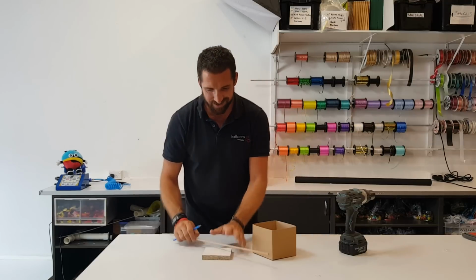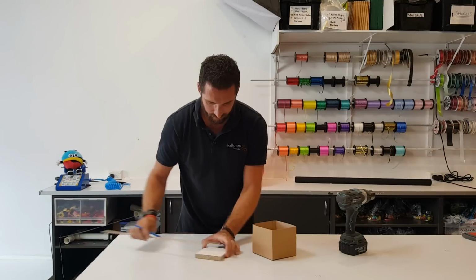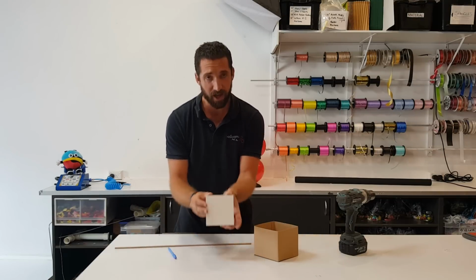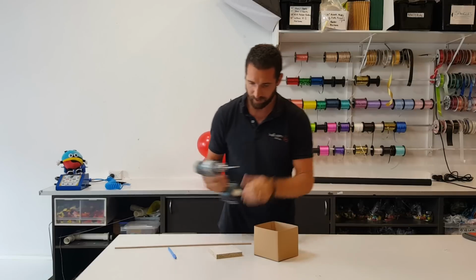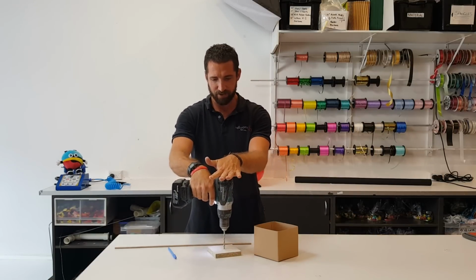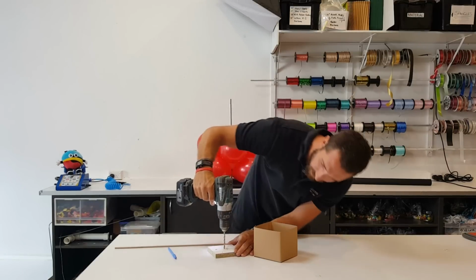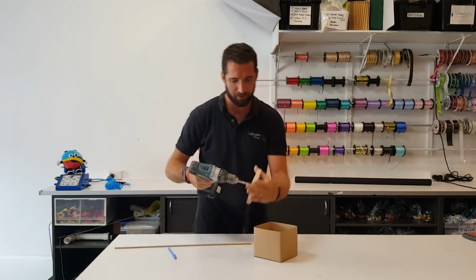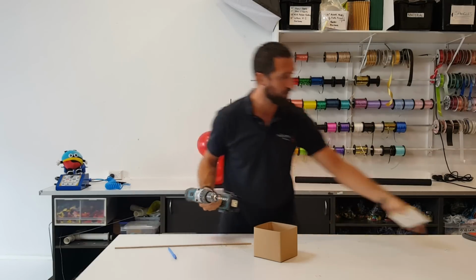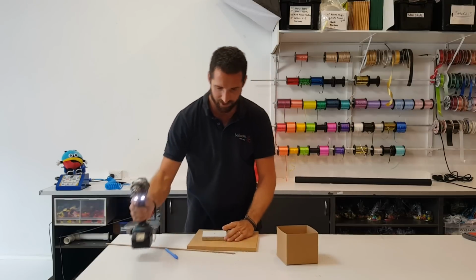We've got to find our center line. So go from corner to corner, just with something that's relatively straight. Corner to corner, we've got an X. Okay. Now, we just drill in. Now, I'm not using a guide this time. Being a topiary, it's so small, it's easy to do it by eye. So start drilling, look on both sides. I don't want to drill through my bench or my hand. You could, of course, have a bit of scrap lying around and drill through that, but I don't.